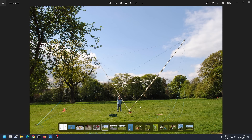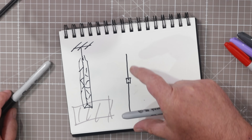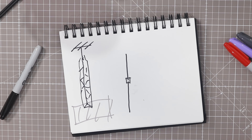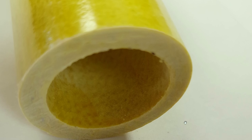I've got a lot of other antennas in the field, so I want to detune this mast. If it were aluminium and connected to earth, at 12 meters it will look like a reflector on the 40 meter band, which I'm worried about. I've found a company that does massive scaffolding tubes with huge wall thickness in fiberglass, so I'm thinking of doing this in fiberglass.